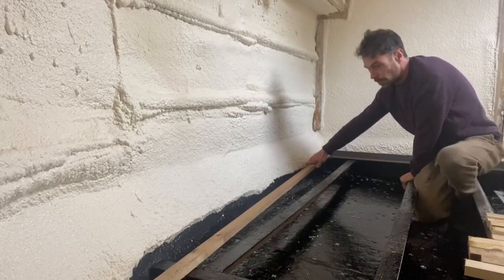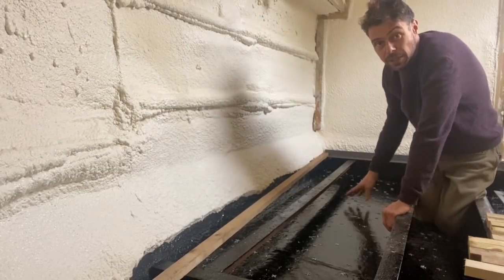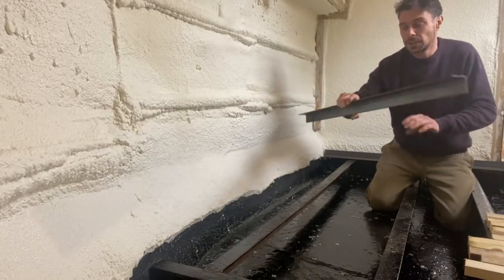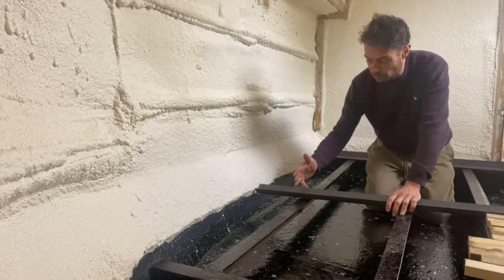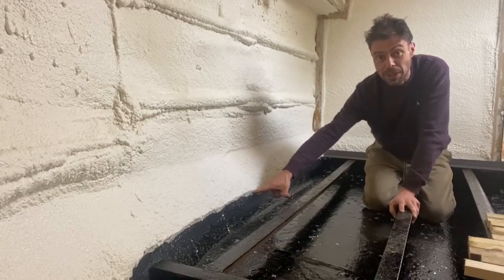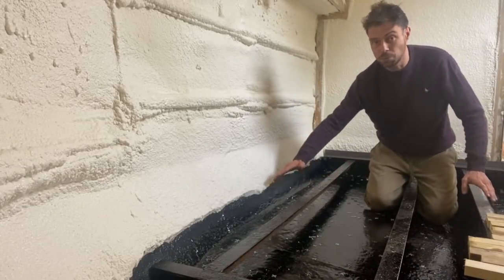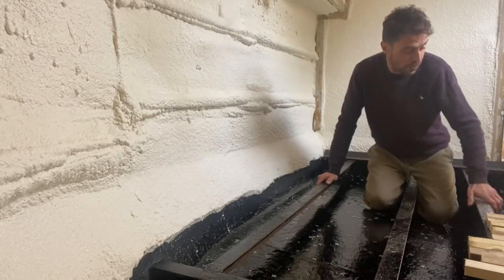When the batten goes in, there's too much flex — that's too much of a bridge gap at seven foot. So what I'm going to do is I've managed to source some angle iron. This is three mil thick angle iron, and we'll cut it at 23 centimetres — so 230 mil intervals — and then get them welded. Paul will do that. Weld and make a brace going across here at 700 mil intervals. They're 210 centimetres long, so basically every 70 centimetres there will be a brace to support the furthest edges of the bays.